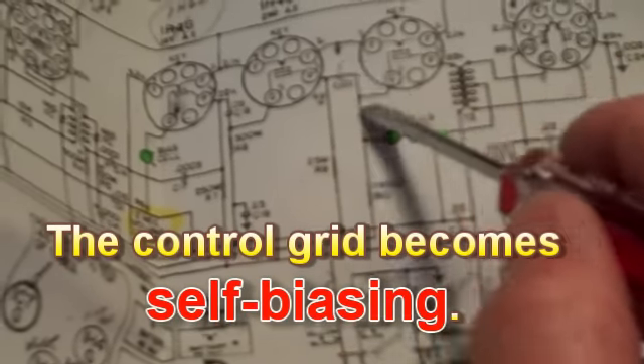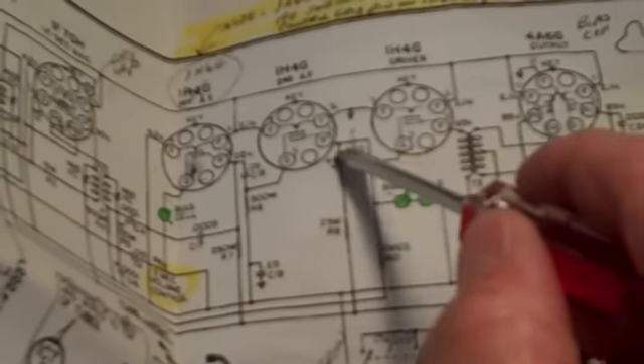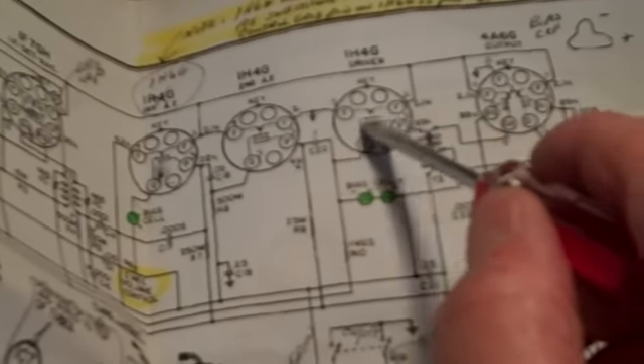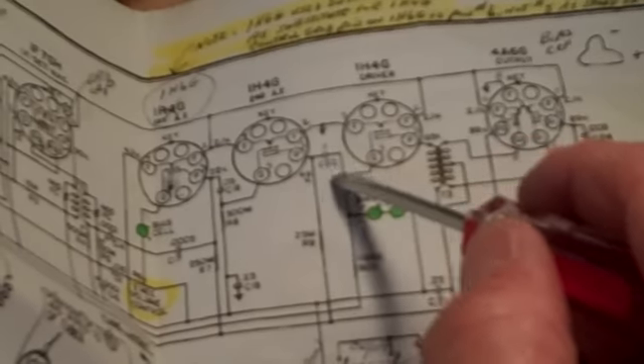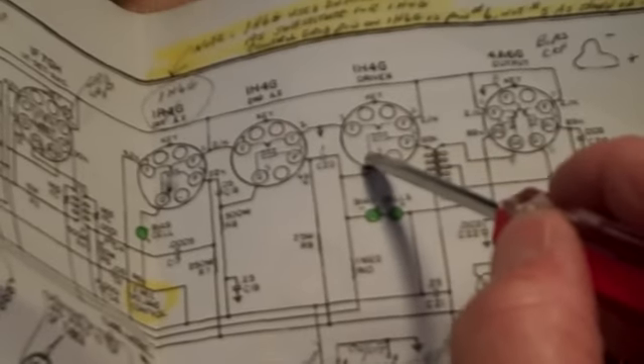But I didn't want to have batteries in this radio. So we came up with a high-value resistor — 1.5 megohms — that we put from the control grid on the driver tube to ground. That resistor works in conjunction with the coupling cap and provides the negative bias we need on the control grid. It has to do with RC time constants and the audio signal working through the cap, through the grid — what would be called grid-leak resistance — working with the internal resistance inside the tube. After a few cycles of operation, it actually turns the control grid into a negative bias, which causes the tube to operate. And just to show you it does operate: before I turn it on, nothing happens. Now — fires right up.